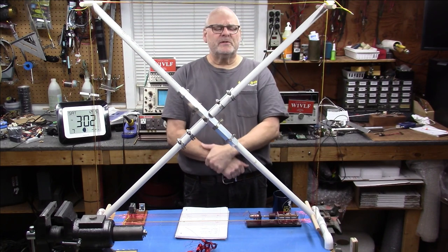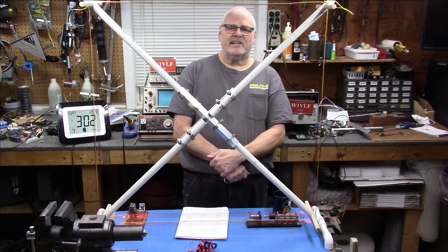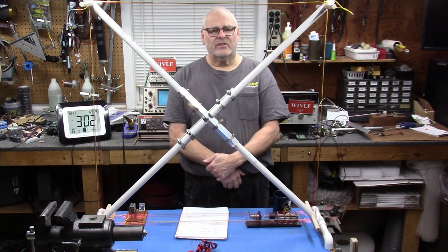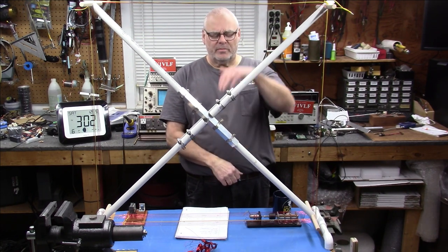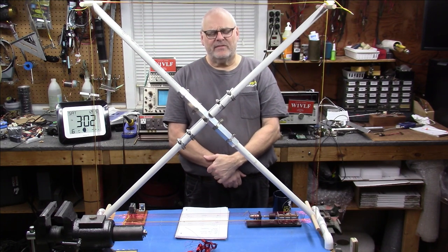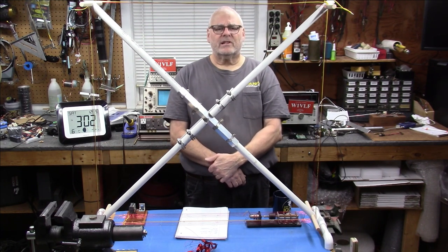Plenty more videos are on the whiteboard over there. They're not all about loops, but there's a lot of really weird stuff, like non-line-of-sight LED communications, cloud bounce. That's one that I've wanted to do for a long time. I had an 8 kilohertz transmitter on the air with a pickle barrel using a loading coil of 22 pounds of number 22 wire. I've got some stuff I want to do on that. Anyway, there's a ton more coming.